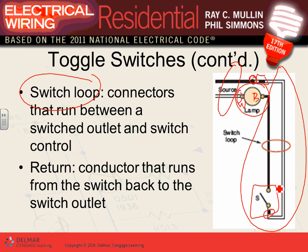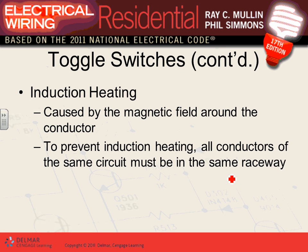Now, Matt, when you're doing the takeoff for this project in the spring, and you have a switch on the wall, and you're looping it with your spaghetti, you're going to ask yourself, what size conductor do I need? There's hot, there's a neutral, one conductor, two conductors. The ground, we don't count. The ground also goes without discussion. So when you say 14-2, guys, these are two conductors, hot and neutral, and a ground. 14-3, these are three conductors, plus ground. So that's how they don't count the ground. Okay, so that's your very simple circuit.